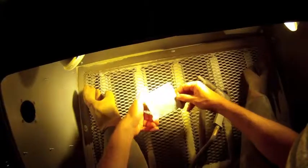First I'm going to blast it with a crushed glass media to get rid of the smoothness and the clear coat that initially was on this piece. You can see now that this part has lost a little bit of its shine and it's got a better surface for adhering powder coat to now.